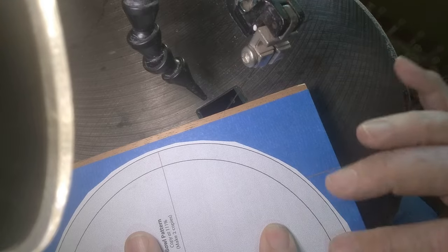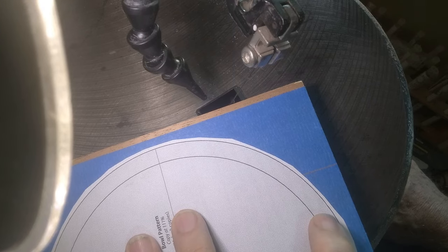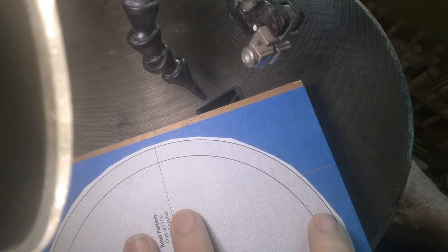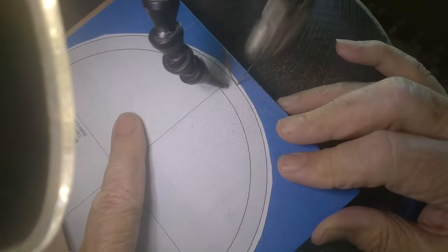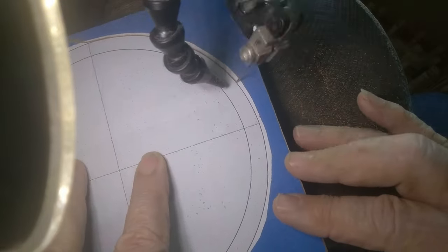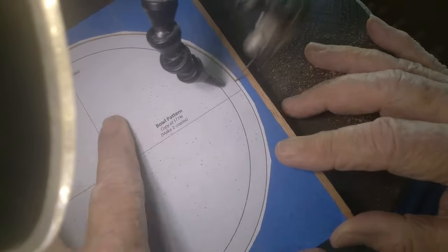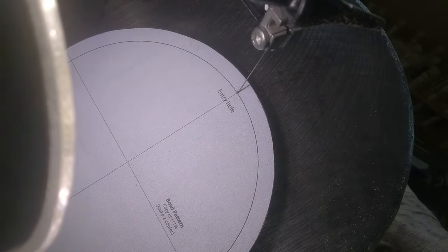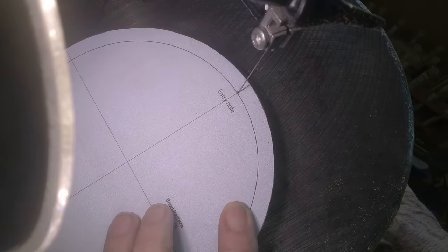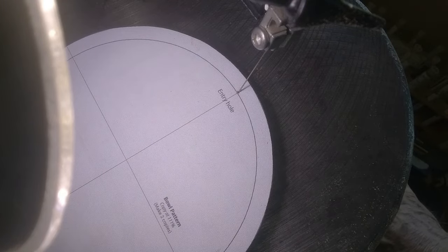I've got the second piece of maple gluing on the accent ring. I'm going to start working on the bottom two rings. I'm going to make this first cut - the outside cut of the first ring. This is the side that's going to glue to the accent ring. I'm going to cut this at 28 degrees. I've gone back to my number seven blade at 28 degrees. We'll cut this, but then we'll change angles and cut the base with a slightly different angle, leaving the outside edge and cutting the base at that different angle.